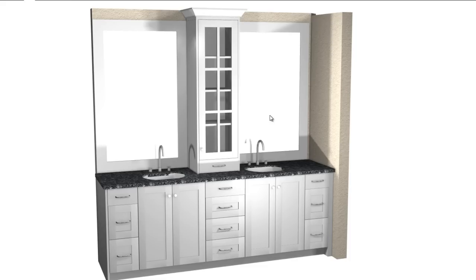I paused the video and went through and added the crown molding, added the toe skin, and did this cool little mirror frame here. Basically I just took some baseboard - they come in 90 inch lengths, solid wood base molding - and on site I would cut these and frame out the mirror a little bit to bring some balance to each side. Without it, it just looked like garbage. I put a piece of mirror in between to show you - there's obviously nothing to reflect off of here, but this is the ultimate goal: to make something that looks more or less like this. You could run these up to the ceiling if you wanted and have the crown molding die off into the face of that.